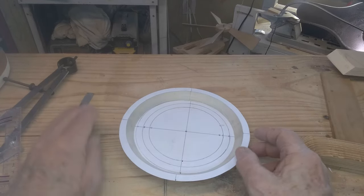I put a little bit of tung oil on it. Poplar doesn't really finish out real nicely. Painting's about the best way to go. Some pieces you can get to work out pretty well. I've done pretty well on some of them with some medium stains. It looks kind of muddy if you get too dark. It's not an exceptionally pretty wood. It's basically a secondary wood for furniture making and such. But it's an easy wood to work with, especially in a practice situation like this.